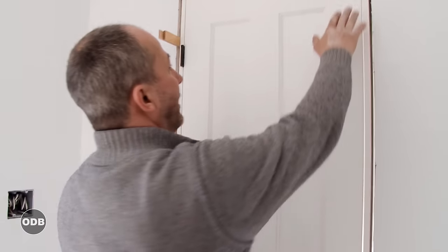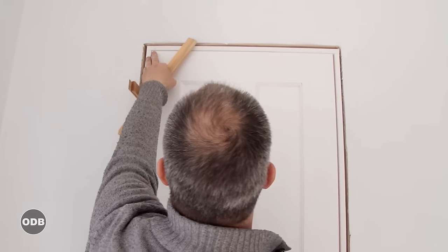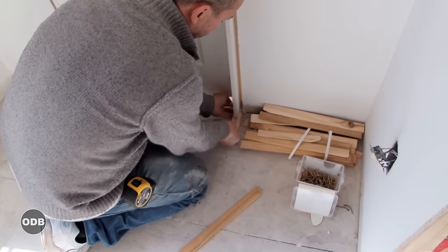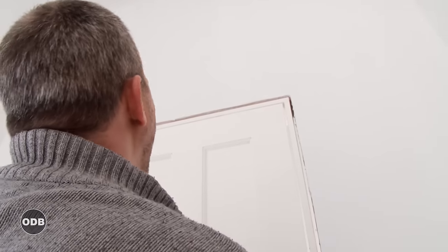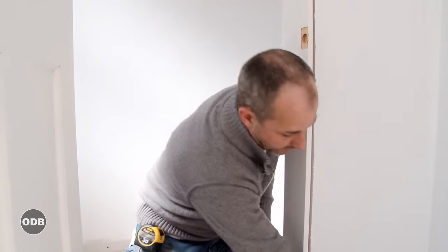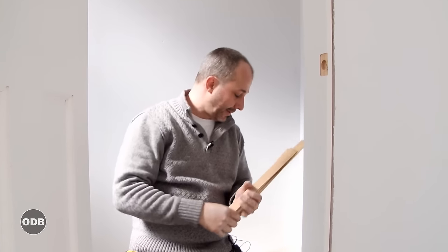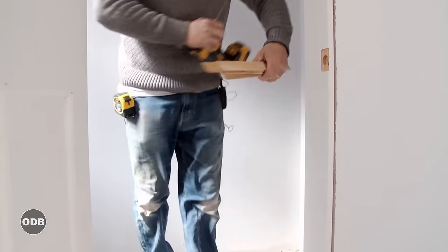Over here we have to make sure the door has a consistent gap. We're a full one-eighth here and we're rubbing. So we come down to the shim — having shims underneath the door is really handy because you can keep adjusting until it's right. The door — perfect. So now we do the same thing again, only we take our shims and start from the top, working our way down, continually working around the frame of the door. If you have any problems, just take one step backwards because that's where you ran into your problem.